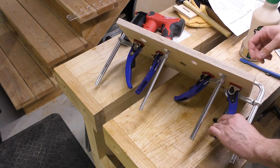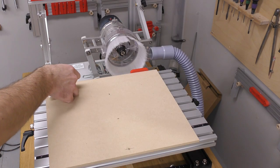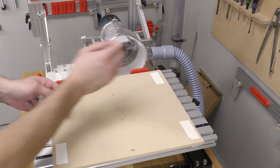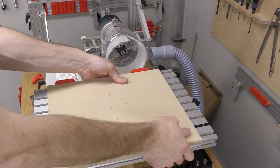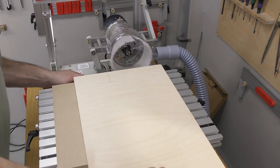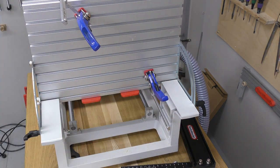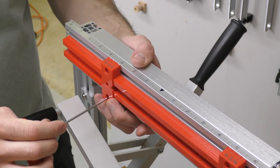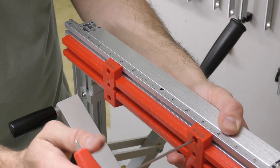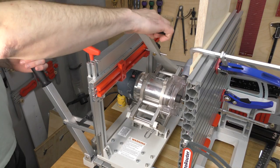Next, cut the elongated slots on the horizontal portion of the jig that mounts to the table. Attach a scrap piece of quarter inch MDF or whatever you have handy to the table using a few pieces of double stick tape. Transfer the centerline from the aluminum table to the sacrificial piece. Lay out the centerlines of your mortise based on the dimensions in the drawing, then align your workpiece to the centerline on the table and clamp it into place on the back end of the table. This task is a perfect application for the vertical clamping jig, but since we don't have one yet, we use the pantorouter table in a 90 degree position.